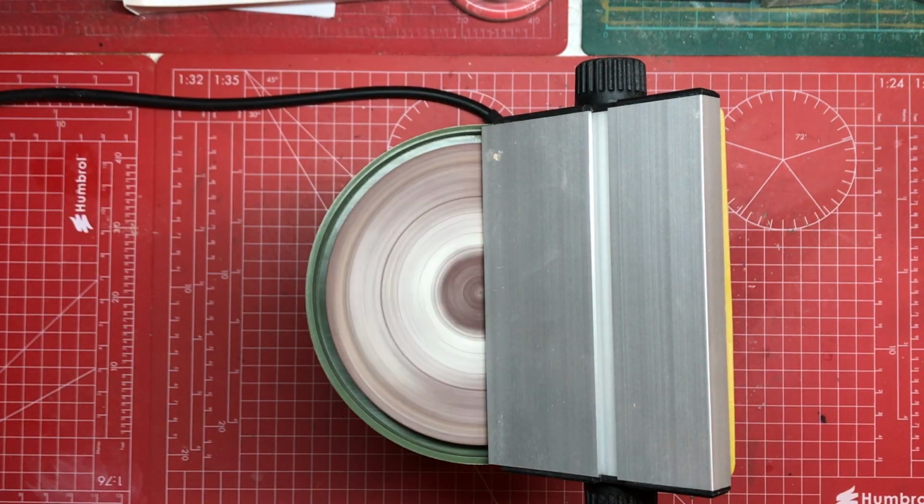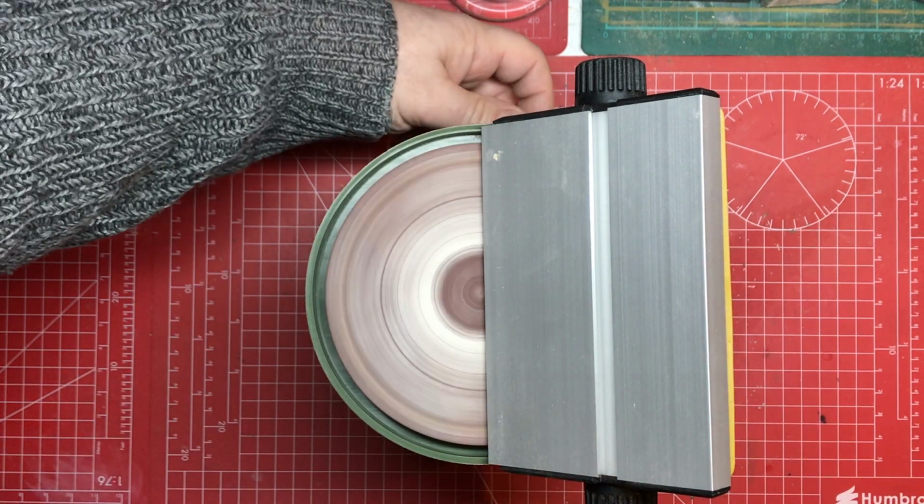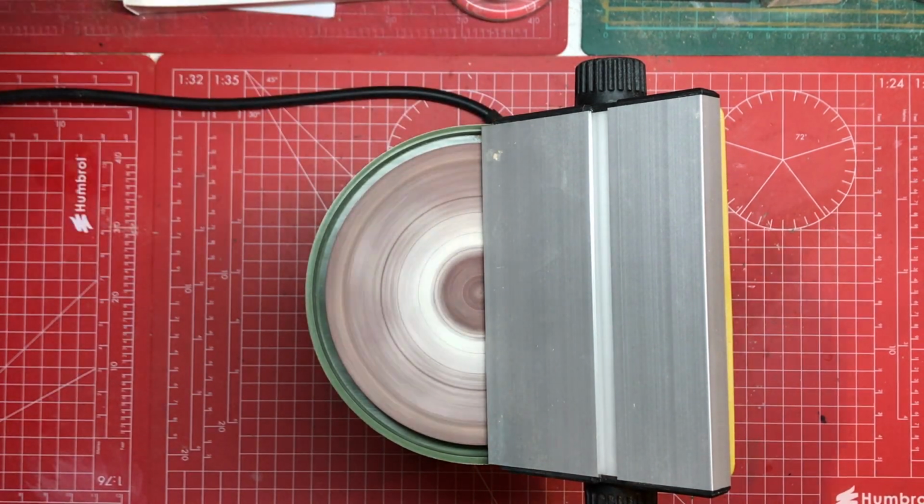So the grinding speeds of the machine range from 250 revolutions per minute to 800 revolutions per minute. It is designed to allow you to do multiple materials, and you need to set the machine at different speeds for different materials. So for woods, for example, medium to high speeds are really fine, but if you're doing something like plastic, then you want to get it right down onto its lowest setting, because obviously the friction causes heat, which can affect your plastic.